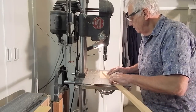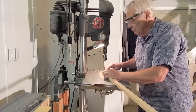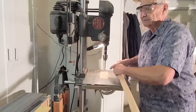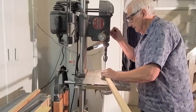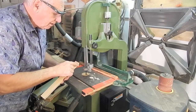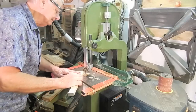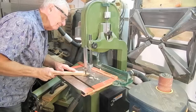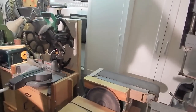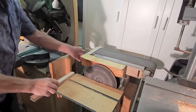I'm drilling the hole in each end of the links. I've changed the drill bit up one size so it'll now be exactly the size of the bolts and the lag screws. To round off the ends of the links, I'm going to use a bandsaw first to just take off the corners, and then switch to my disc sander to round off the ends up to the line.